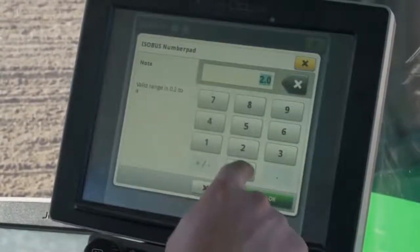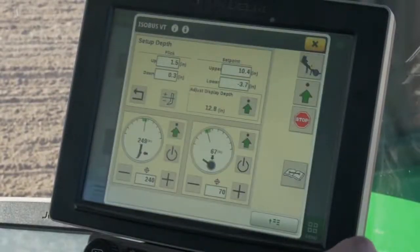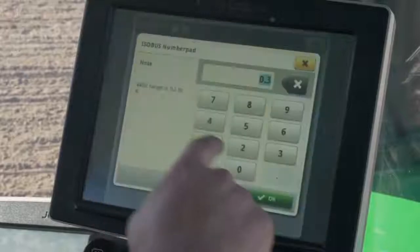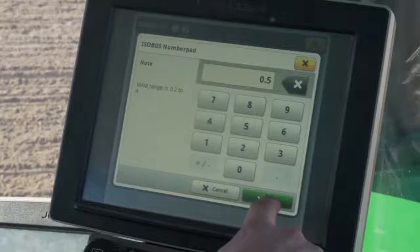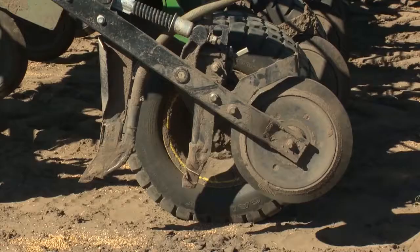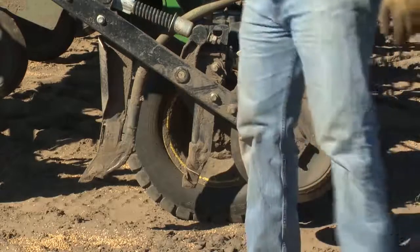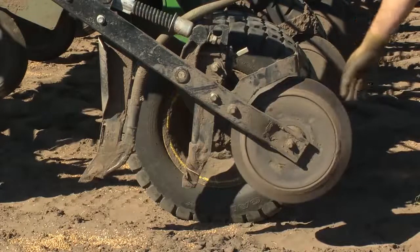In order to enter these values, select the Settings button and enter the values in the flick input boxes. Also on this screen, operators have the ability to manually set upper and lower limit set points if they choose. The flick increment can be set to small increments, but a larger flick adjustment can be made as well. Another John Deere design advantage is the separating of the fertilizer shank from the packing wheel — customers are well aware that soil conditions can change within the same field, and this design will allow operators to make either adjustment without leaving the cab.